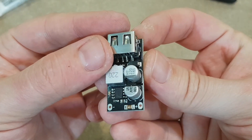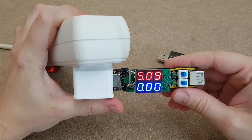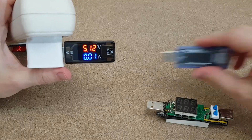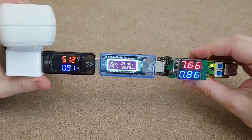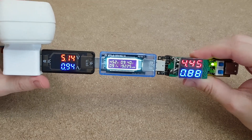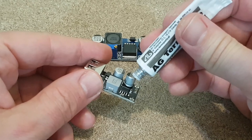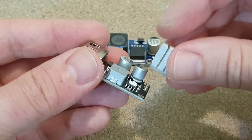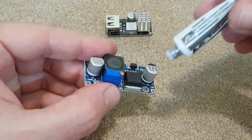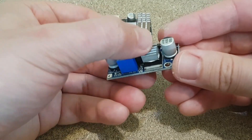It will be connected directly to the module output. You may be wondering why I removed the USB plug and not just simply joined them together through the USB connectors. Let me show you what the problem is. This is my USB load tester — it's connected to a simple charger and you can see it's showing more than 1 amp. But when I connect more USB testers in series, the voltage and current values are decreasing towards the final load. That's because these USB connectors don't make a perfect contact, each connection adding a resistance in series with the load. But before soldering the modules, I want to add some heat sinks. I will use thermal glue to stick them to the integrated circuits. Be careful with the heat sink on this small circuit board — it only needs to touch the IC, not other components. You can easily short that tiny capacitor. I will also add a small heat sink to the step-down converter IC. It gets a bit hot when it delivers more than 1 amp. This is a closed enclosure, there isn't a lot of cooling going on.